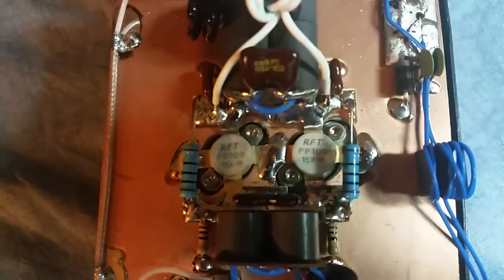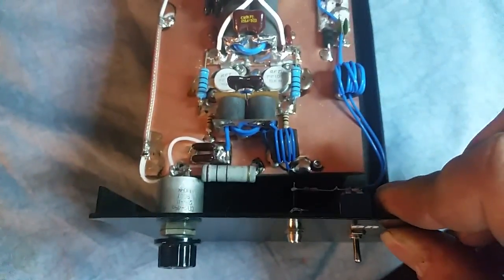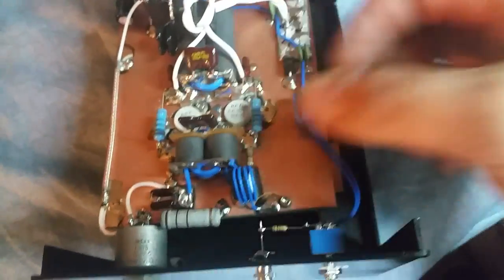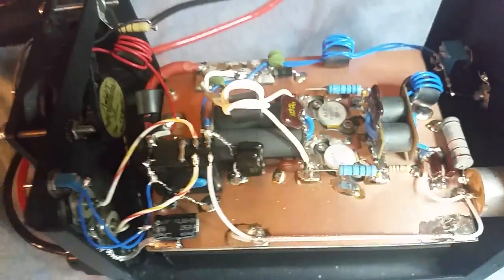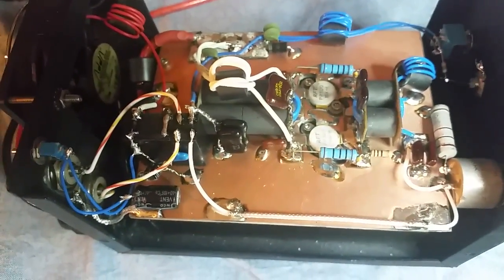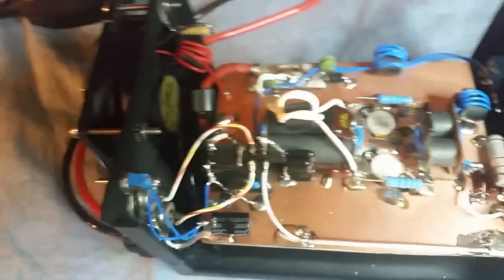Anyway, there they blow. Like I said, those transistors are only 2 weeks old. Maybe 3 at the most. This amp is freaking right off the hot plate, man. Fresh off the hot plate. I ran straight over here and done the video. Tuned it out, individual tune. Pretty unique, man. The output tuned out a little higher than I thought it would. Tuned out there around 160, 65 picofarad. That's pretty unique. I double checked it though. It's kind of unique, but that's what it was.